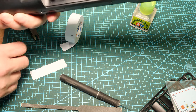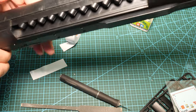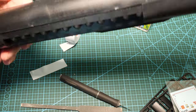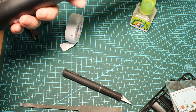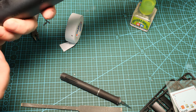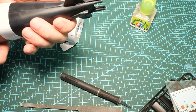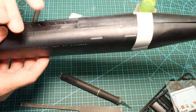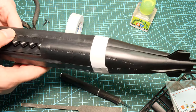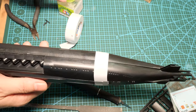Hold it nice and tight, wrap that around. Now these parts are pretty much locked together. Do another one here — there we go. So now we are really dry-fitted. You can see how much it bows out here, so we're not going to start at that point. Instead we're going to work successively — not glue the whole thing in one go, just glue one section at a time. It's really the best way; have some patience with this.